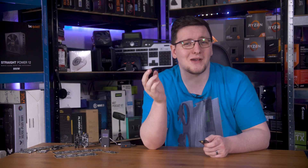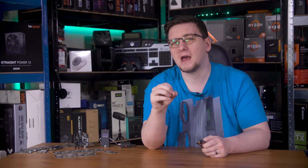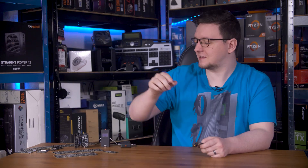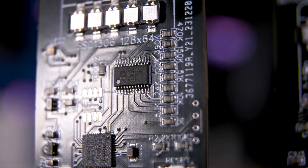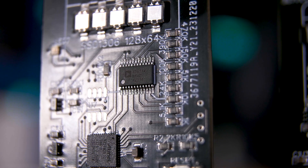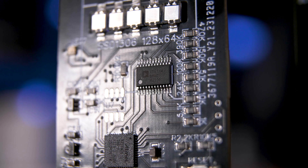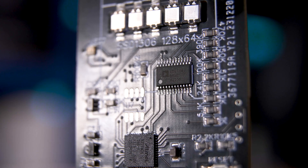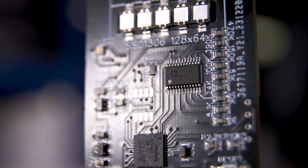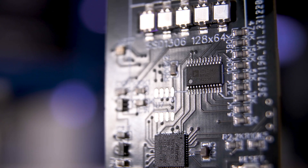This legitimately took me a month to fully diagnose and genuinely had me in utter despair not knowing why it was suddenly broken. While even now I'm not 100% sure, I'm pretty convinced that it's the PCBs themselves that are at fault — specifically the footprint of the ADG714. Maybe the pads are just a bit too close, and especially after heating from the bottom rather than just the heat gun on top, they started to warp slightly or otherwise short, to the point that they were basically foobar. It turns out that happened on the newer design of boards too, so I had to redesign that part.